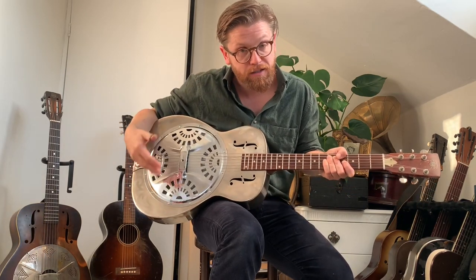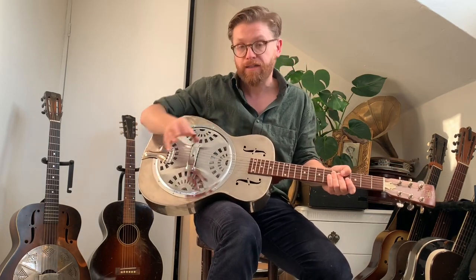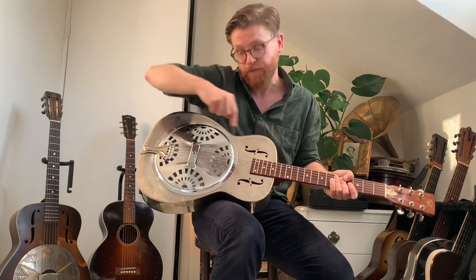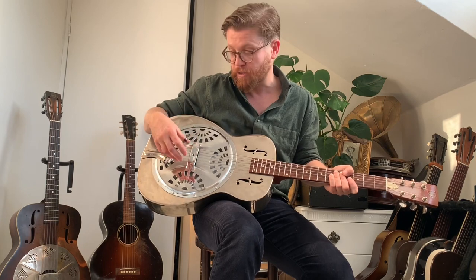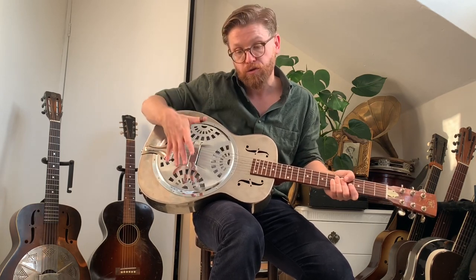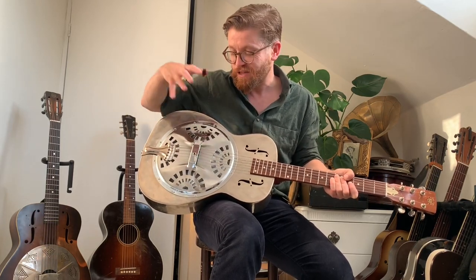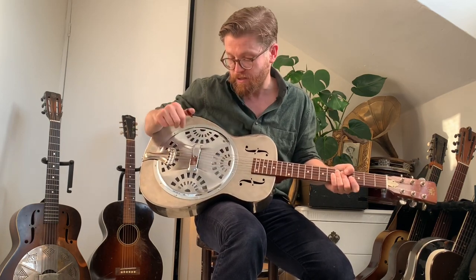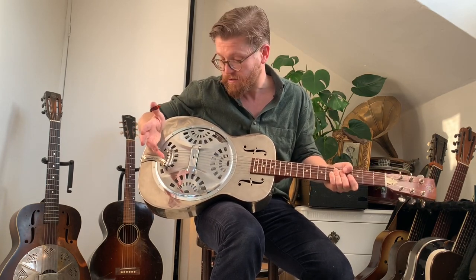They had a former or die made for spinning these 10-inch cones which had eight ribs to strengthen them. When they moved premises, apparently they lost that piece of tooling, so the cones they were spinning — plain cones with no embossment — were collapsing. So they spun them out of thicker aluminum. Those are two reasons why these guitars might not project as much as other resonators. Does it affect the sound? We're going to listen to it next.